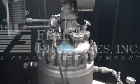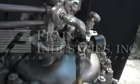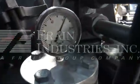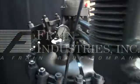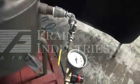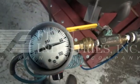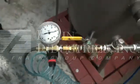Here we're pressure testing both the internal pressure and the jacket pressure. Here we have our airline in for the internal pressure. You can see it's currently holding at 60 PSI. Here we also have the jacket pressure — this one's currently holding at 90 PSI, or just under 90 PSI.